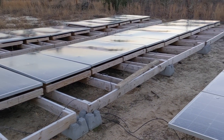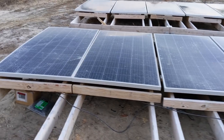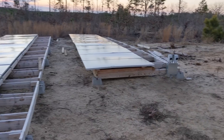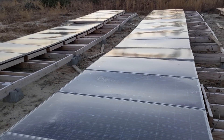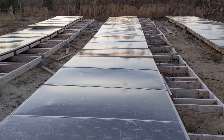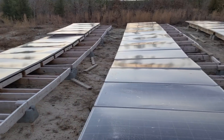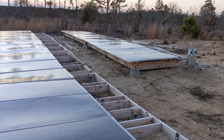This will allow him to limp along — he can get water, charge the battery, run some lights — but it's not what he planned on. We're going to have to regroup with him. We'd love to come down and build him a beautiful ground mount someday. We can salvage a lot of what we did in terms of disconnects and home runs, but this did not work out. If you think you're getting a good deal on free or close-to-free panels, sometimes you're not — a panel can test out on voltage but as soon as you put a load to it, it's done.